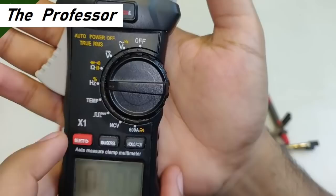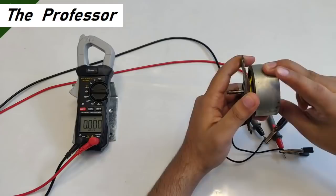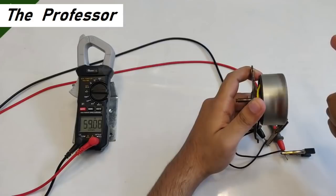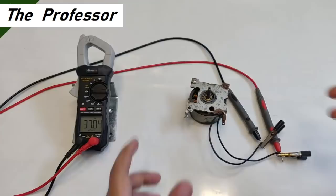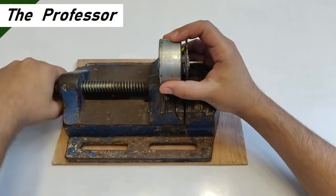Almost 6 volts from hand rotation — single-phase AC. I've pointed the meter to frequency measurement mode to see what frequency I'm getting. Obviously it won't be constant because of the change in speed: 50 Hz, 43, 12, 55, 59 Hz. The more the RPM, the more the frequency, but we can manage it by fixing the speed of rotation.